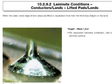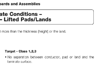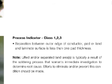To provide some guidance for the member, we tried to look at IPC-610 because it certainly doesn't match the requirements of IPC-600 — we need to look at an assembly condition. In IPC-610, paragraph 10292, it indicates that the target is no lift, but there is an allowance of acceptability of a land up to or less than one pad thickness — one land thickness — in the resulting assembly.